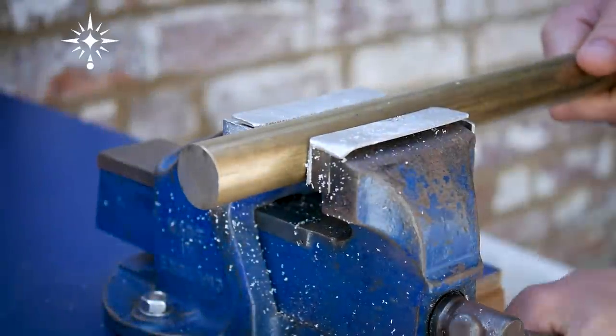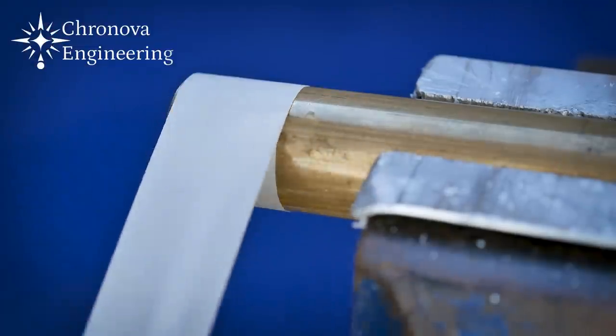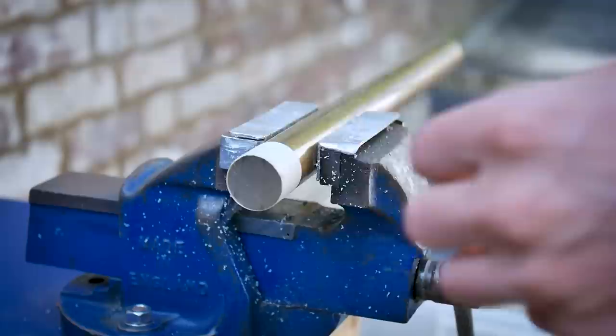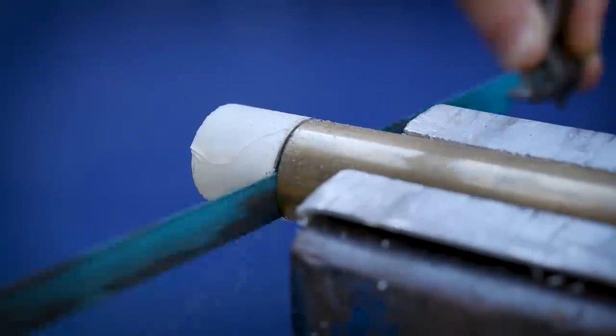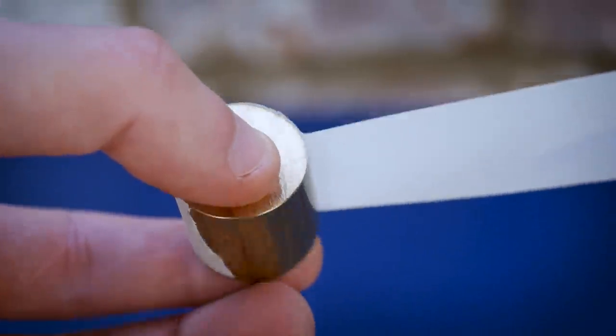The lathe is a simple machine. It is a single powered spindle which the workpiece is mounted to, so the workpiece can rotate in only one axis at a time. Yet, with some thought, complex shapes can be made. Because of this, as a general manual machinist, if you were to own just one machine, it should be a lathe.